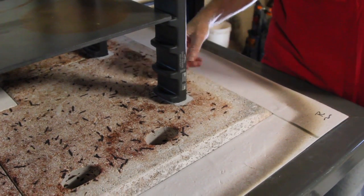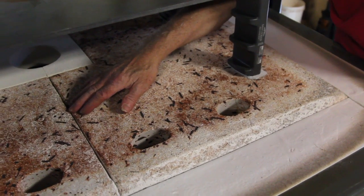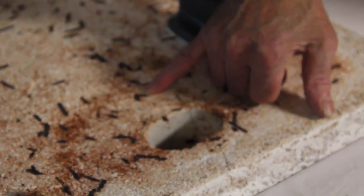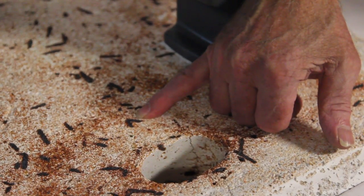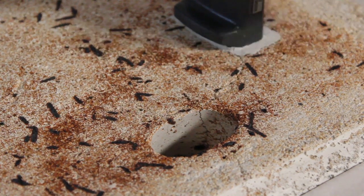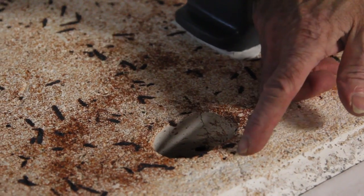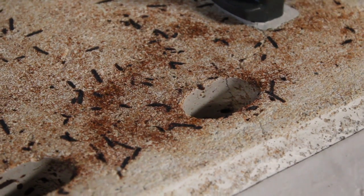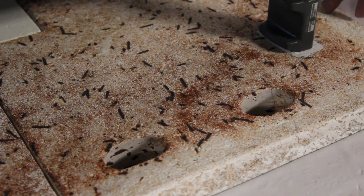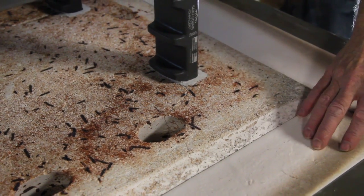The kiln pad is cast in four quadrants for expansion and contraction. The castable is a high-temperature refractory with stainless steel crimped wire reinforcement mixed in. On the surface it burns up, which isn't much of a problem, but inside, if the refractory cracks, the reinforcement keeps the cracks from propagating and keeps the pieces together. This has a few cracks but nothing substantial. This step seals against the fiber, and this is a piece of fiber gasket material that also seals.